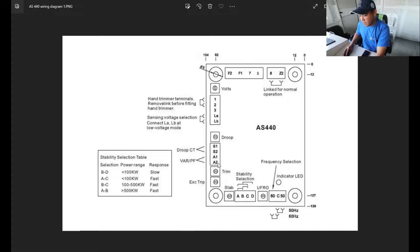Down here is your trim point for the 0 to 5 or 0 to 10 volt biasing. This trimmer has 360 degrees of rotation representing 100% of your trim. If you put it at half, you have 50% trim for your digital biasing.